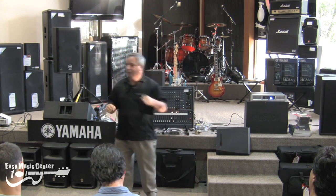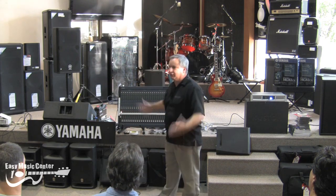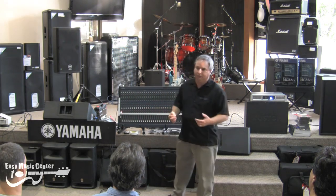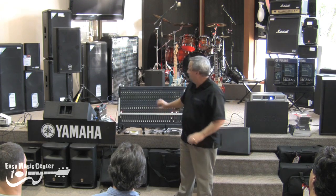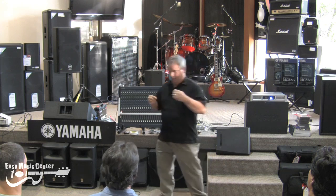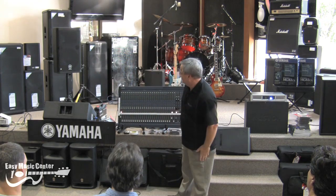All right? The third thing you can learn from microphones: any microphone you have on stage you're not using, turn it off. Turn it off at the console. Don't leave them on. The more mics you open up, the lower your gain or volume before feedback happens. And we all are fighting that, you know, I want a little bit more, and it's always right on the verge of feeding back. The easiest way to fix that is turn off mics you don't need. So if anybody uses choir mics that are hanging mics, again, they're too far away from the source, and people tend to turn them up with the mixer, and then they're picking up the actual sound from the speakers.